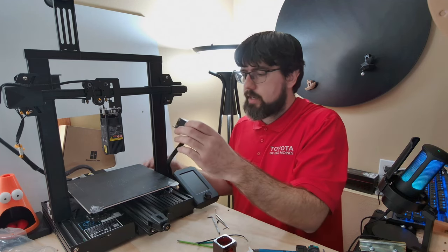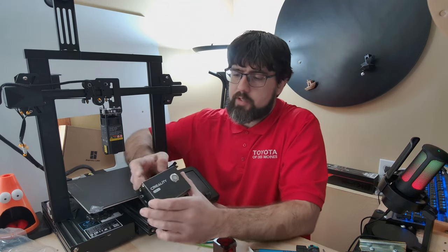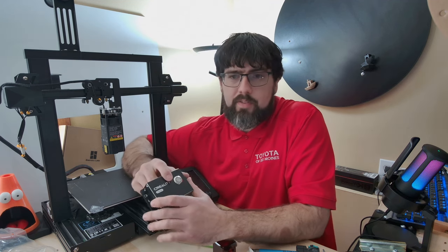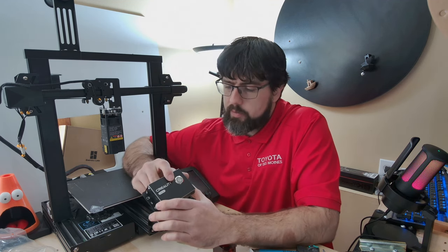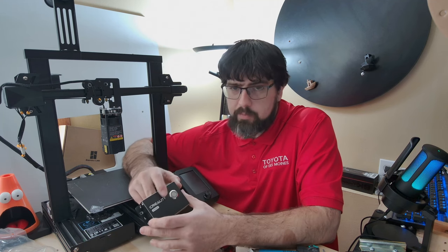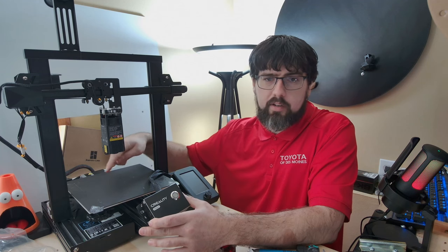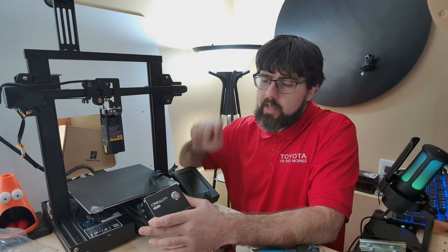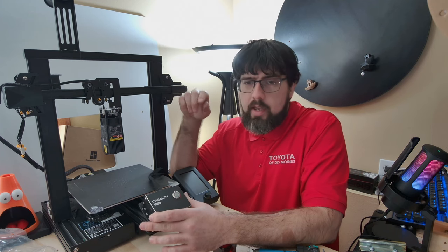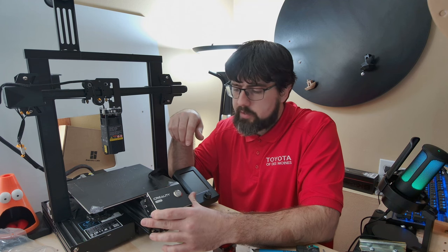The Falcon box is controlled with one button, so you can only load one file at a time in offline mode. You start it up, push the button once and it traces the outline of what you want to cut — framing — then you push the button one more time once you're set up and it will start the etch or cut, whatever you have set.